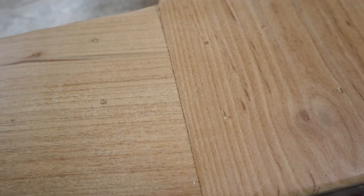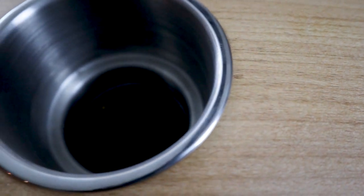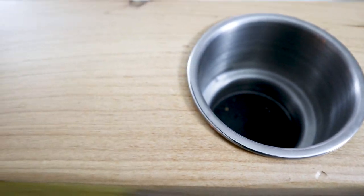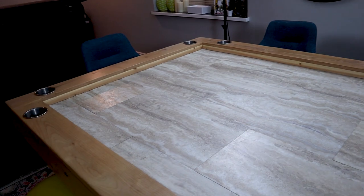I used wood glue and I took the finer shavings and mixed that into the wood glue for my wood putty to patch my joints. I also didn't have a nail gun, so nailing some of the finish on the outside and top was a pain. I had to pre-drill every nail hole and then nail it with a hammer because those finish nails were so fine, but that took a long time.